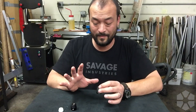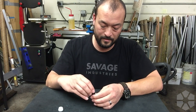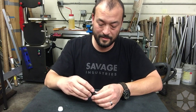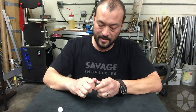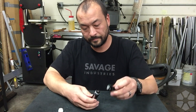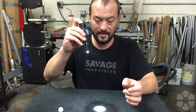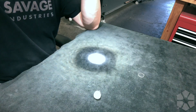We machine these reflectors in-house. I'm going to put this back together with the standard reflector first to show you something. Again, don't push it — wiggle it gently, and if it feels like it's going to get stuck, stop or you'll jam it in. Then screw the head piece — you could call it the pill — back in, make sure it's snug as it seals against the O-ring in the front. Get the battery back in and screw it down.